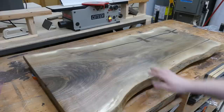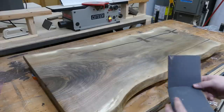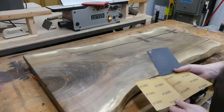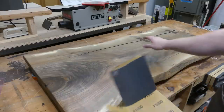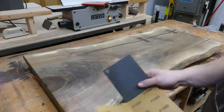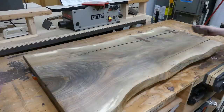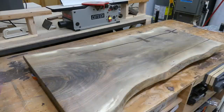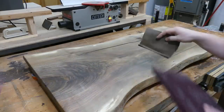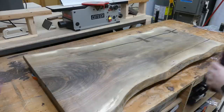I've got one coat of General Finishes Armor Seal Satin on here. As part of my finishing process the next step I usually only sand with about three or four hundred grit, but because of the epoxy — and if I accidentally hit that — I'm going with a thousand grit to hopefully not scratch it up too much. We're just going to scuff the surface and take off that first coat. I don't even need sandpaper if I have the Scotch-Brite pad, so I'm going to do the edges with Scotch-Brite pads — that'll be easier to get the curves.